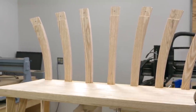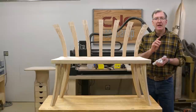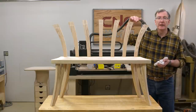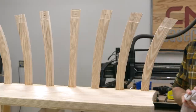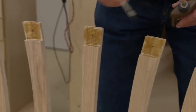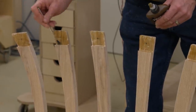That's the last upright in place. I'm going to set the bench on the floor now because it will be a little more convenient to work on. Our next and last step is to go ahead and put the crest rail in. The crest rail sits in these laps — it'll be glued — and I've drilled a hole through each of these for a one-inch screw to reinforce things. Once the screw is in place, I've got some plugs cut to plug the holes.